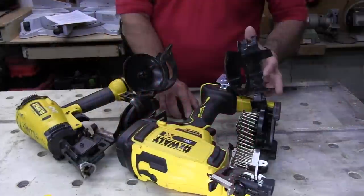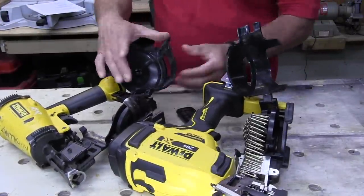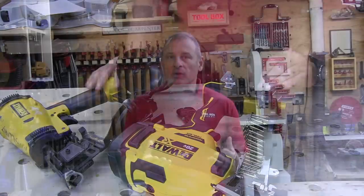The nail canister housing is made out of thin plastic and is not as rugged as the pneumatic nailer — not a favorite. Just moving the cordless nailer around on the shed roof we were working on, it popped and coiled the housing open a few times, which is annoying. The thinner canister cover is probably a trade-off to cut weight off the already heavy nailer.